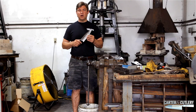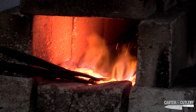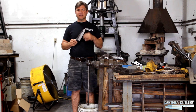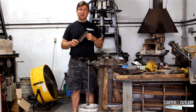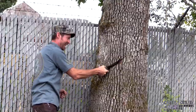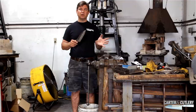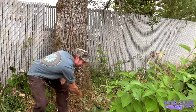The third reason why a blade may chip is it might have really fine-grained structure, forged, annealed, and quenched at the perfect low temperatures, and then was tempered properly, but just too thin for the task that you're asking the blade to perform. The most obvious example would be trying to cut a tree down with a really thin, straight razor blade. The blade can be the best steel in the world, but it's going to fail and crack and crumble if you try to abuse it like that.